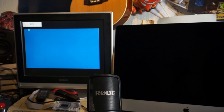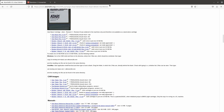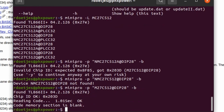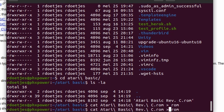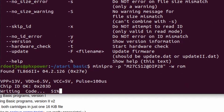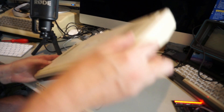Now this is what is wrong with the Atari — when I switch it on, it goes straight into the self-test instead of going into BASIC. So now I need to download BASIC. I download the Rev-C, the latest version. I first check whether this EEPROM that I bought is blank — yes it is, cool. And now I will concatenate the BASIC C-ROM 8 times, filling up the whole EEPROM. This way I am guaranteed, no matter what the addressing is, that it will start. The adapter should actually fix that problem if you store the BASIC ROM on address 0, but I'm better off being safe than sorry.